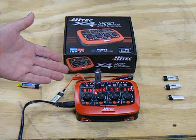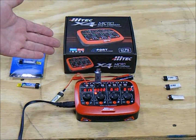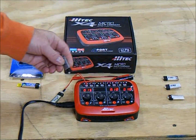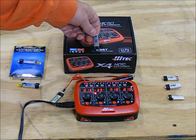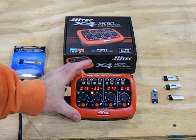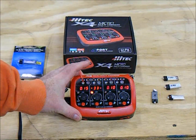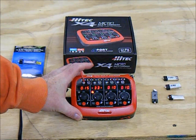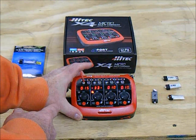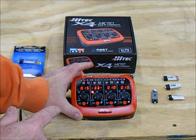When a battery is below the threshold of charging, the charger actually shows an error — a hyphen-33-hyphen display — which tells you the battery is no good. So regardless, it will let you know whether the cells are good or bad. It gives you the voltage, the amperage at which the battery is being charged, and the amount of milliamps going into it. So if you run a battery fully dead, you can literally check to see how much charge goes back in — if a 150 milliamp hour battery only accepts 100 milliamps, you know a third of its capacity is no longer usable.